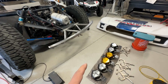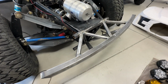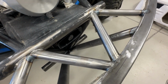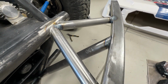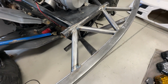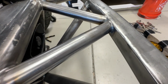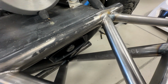Let's take a look at two things before I go ahead and get the lights and the hood back on the truck. We'll do a little bit of painting also. There's a little bit more fabrication left to be done, but some big validation points here. One is that the Dragon A250 worked amazing. The fitment here was just perfect. There were no gaps or anything. It really made this an easy weld, and that's the basic foundation for any good welding, is just cleanliness of the material. I thought the surface conditioner did a really good job with that. And also the gaps are just really small and made it really easy to make. Well, I thought there were some decent welds. I'm not the best welder in the world, but I've never had a weld fail, so that's pretty good.